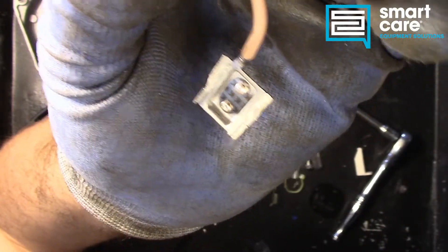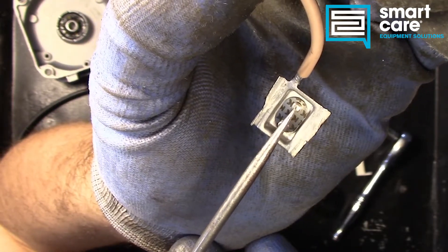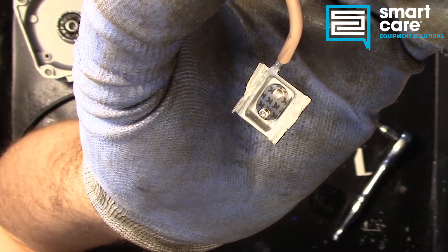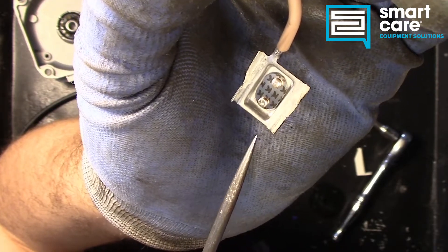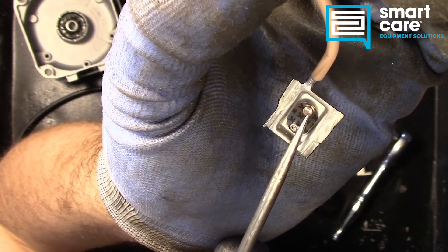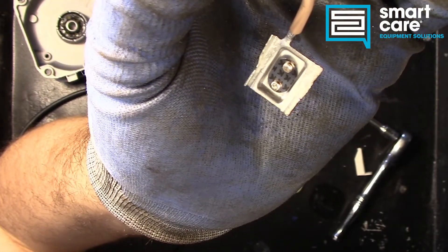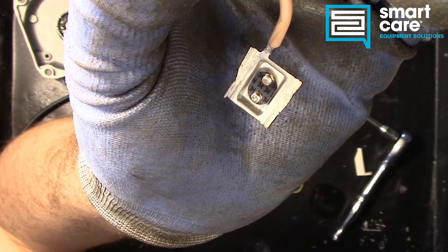Now that being a little electrical switch, it's putting load through this little tiny tab there. So if you were to have any kind of high current draw on this motor — like if it was locked up — when this switch auto-reset, it would throw a little arc when it came back in contact with the other pad. And eventually it could weld itself or burn itself open and stop working entirely.